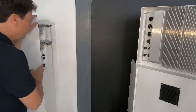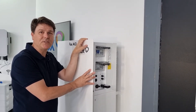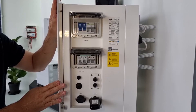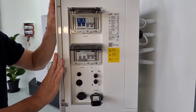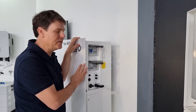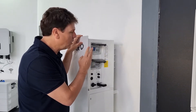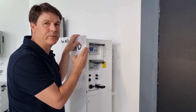The Fox All-in-One Hybrid is an all-aluminum IP67 device, so it can be installed outside in the shade. They've made it a completely plug-and-play system, including all of the inverter-side switchgear plus more that we need on the inverter side.